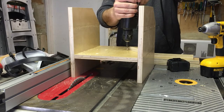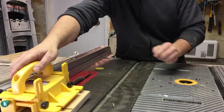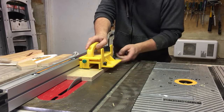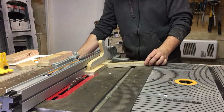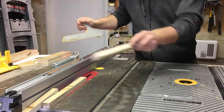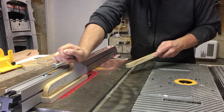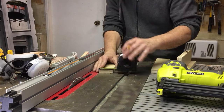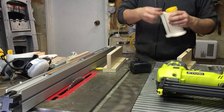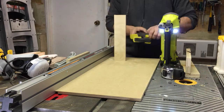You can see I have the lower shelf attached and I'm drilling the holes for the drill supports. I'm using just that scrap piece I cut off — it actually worked out perfectly, but you'll have to figure out how big your drills are and how much space you need for each one. For the drill storage area down on the bottom of the unit we're making three sections, so you need two center units as well as two side pieces. Just lay out the middle — you can see what one of the center sections looks like: just a spacer as well as a strut down below. Put a little bit of glue on there — you can see I'm using my glue bot, I love that thing.